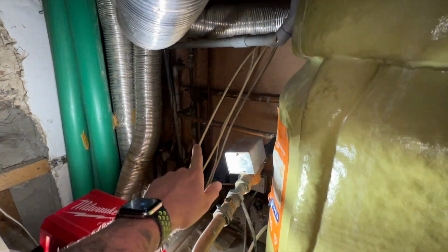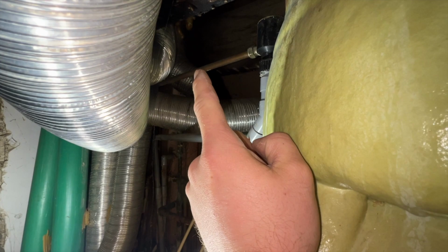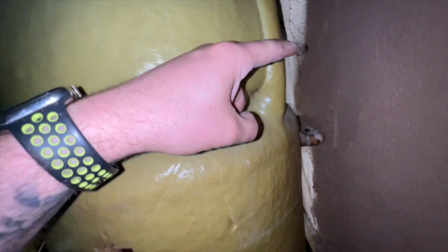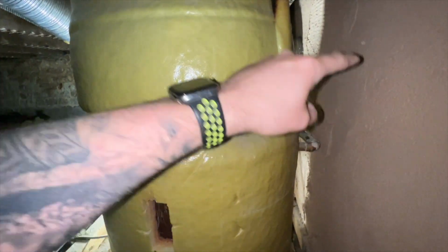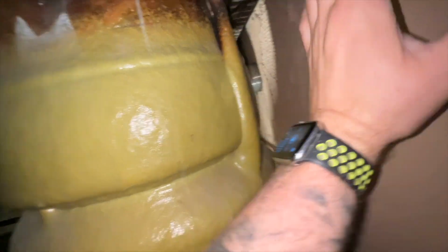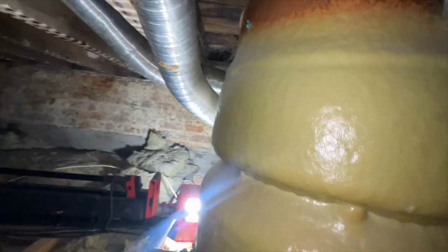And then if we come round that side, we're going to cut this down over here so we can get our 300s for our PRV, and then straight into there, and then that goes outside. Cold main up there, cut that, put a lever valve on that. And then this is the hot outlet, so obviously this will need to be cut back, and to be honest, the 700 I think it finishes about here, so it'll have to come out and then drop down into it. But then the cold main, obviously with a new lever valve, into the pressure reducing expansion vessel on here, into the bottom of the cylinder, then obviously hot out back onto that. These go, try and get this out of that hole, and then yeah, jobs are good then.